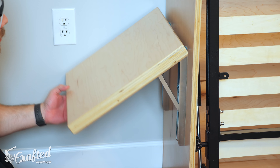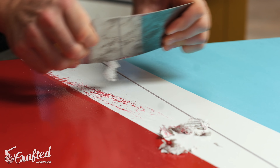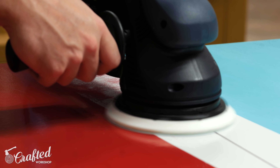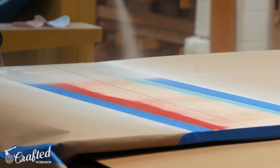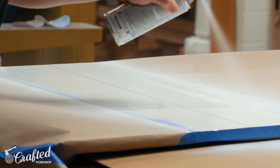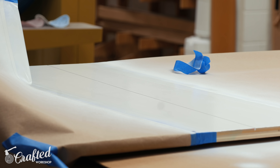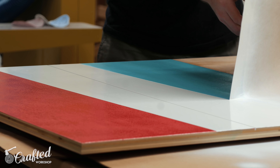With pretty much everything done on the bed except for the doors, I could go back and deal with that crackly white paint. I started trying to remove the paint with a card scraper, but it was pretty tough — my card scraper probably needs sharpening. I figured this would be the perfect job for my new Rotex sander, and it was. The paint was still a little sticky so I had to replace the sanding pads a few times, but it removed all the paint in about three minutes. With the paint removed, I remasked the area and applied a few coats of white paint in lighter coats so things dried faster. This worked extremely well and I got basically perfect results — except for that stupid bug that landed in the finish after the last coat. After the paint dried, I removed the painter's tape, and there's just very little as satisfying as clean paint lines. The red paint has a bit of a weird texture because I knocked down the gloss with 400-grit sandpaper before applying the white, and I'm going to add paste wax once the red fully dries to give it a nice matte look.